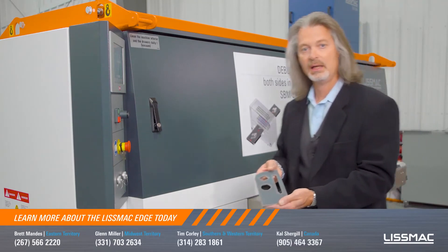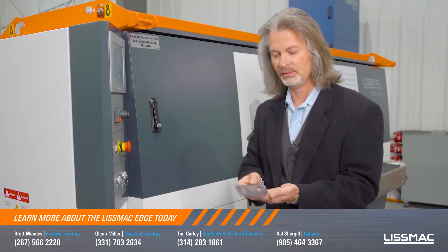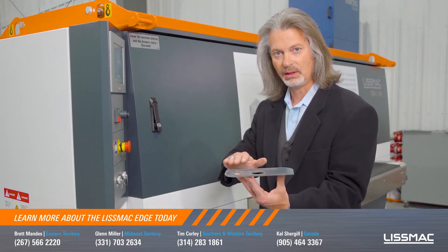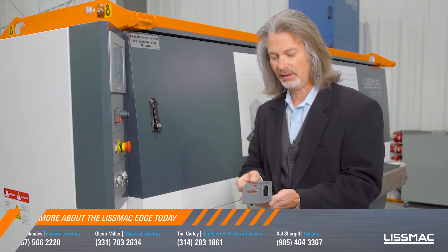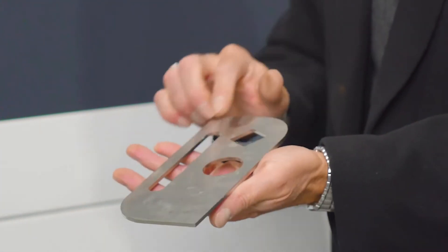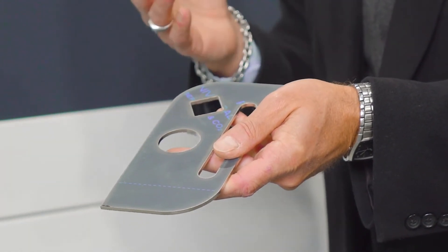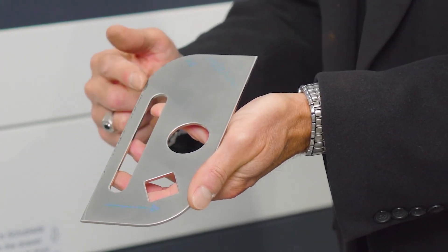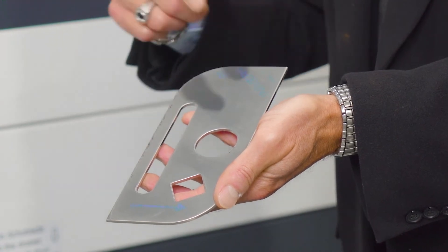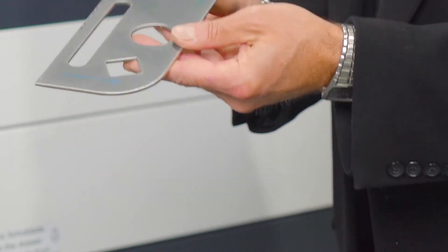We can also take a pre-finished and coated part with laser paper and deburr it without removing the laser film. In practice, a sheet on a laser table is film up, burr down after it's cut. There are customers that need a rounded safe edge on both the bottom and the top. With this machine you have the ability to match your edge on the burr non-coated side to an edge on the non-burr coated side. The result is a rounded edge with your paper intact, meaning your pre-finished look is intact, plus the Lismac Edge on the bottom — achieved in a single pass.